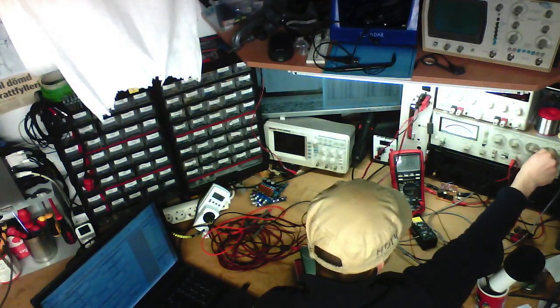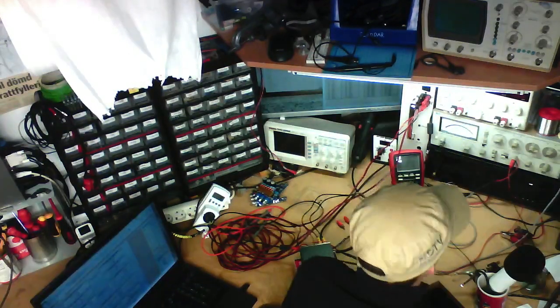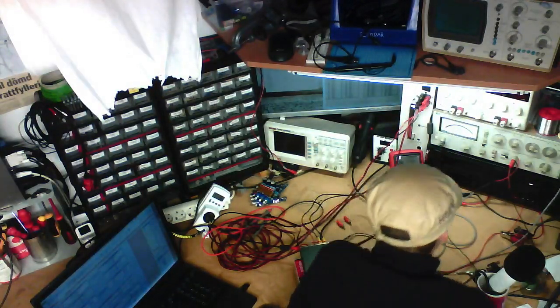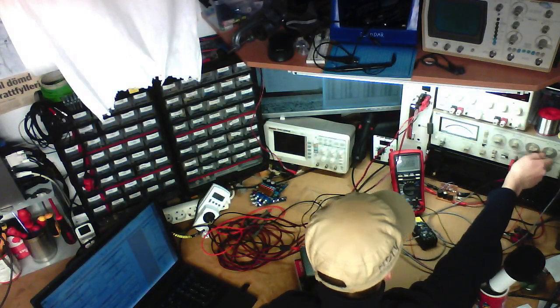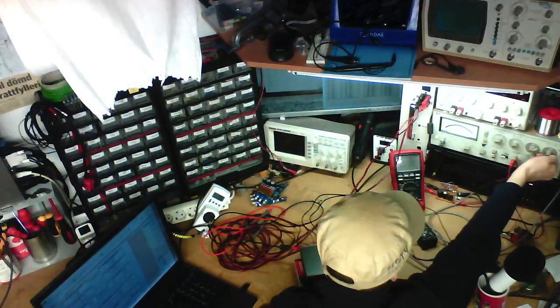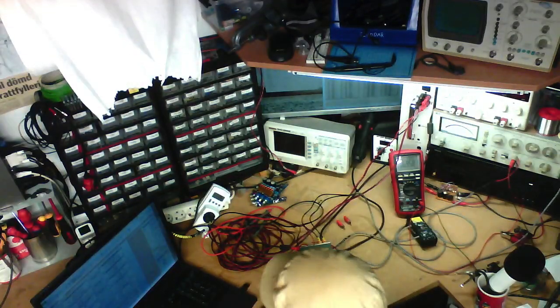20. No, hang on. We've actually got... At 4 ohms, it's actually rolling off quite considerably early at the high end. We're down 2, 4, 6 decibels at 20 kilohertz. That's not very good. So minus 3 decibels at 13 kilohertz. That's silly. 13 kilohertz.